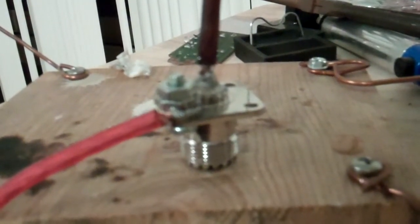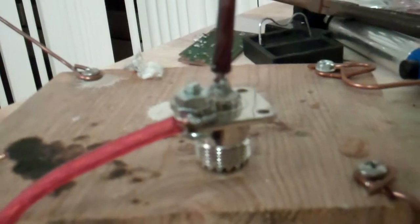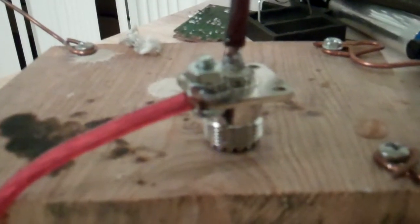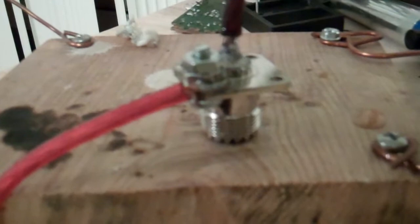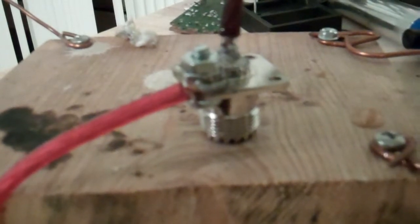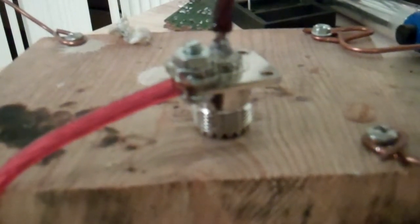So this is the homemade 102-inch beam single antenna I'm building. The project won't be complete until I finish all the other steps. I'll also be running this on an analyzer probably tomorrow to check it out — I'll probably want a 50-foot cable to hook up and get an idea of the SWR. When I do some trimming down to 102 inches, somewhere in that range should be okay.